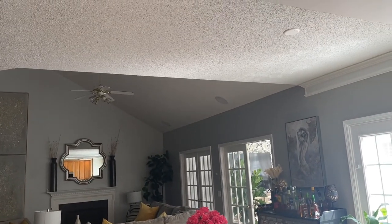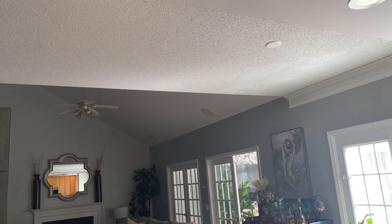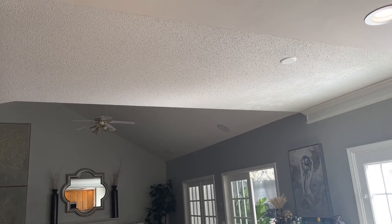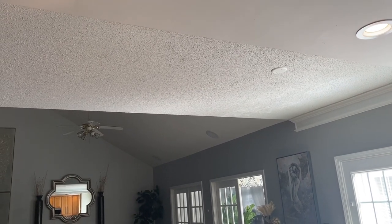What I need to do is make sure that I find something in that ceiling that's strong, such as a joist. Hopefully I will get lucky and there is one there. If not, then I might have to do some drywall tearout.